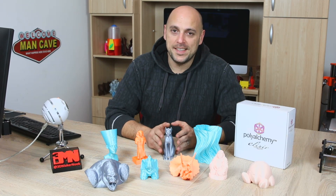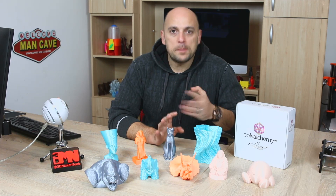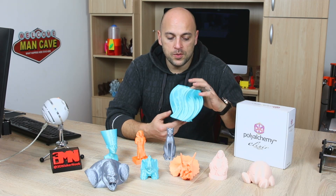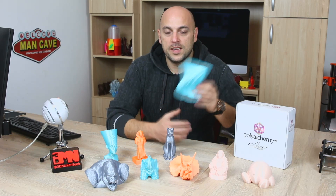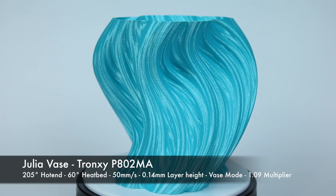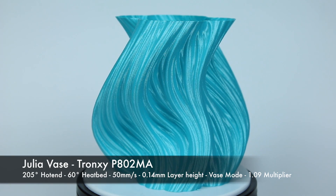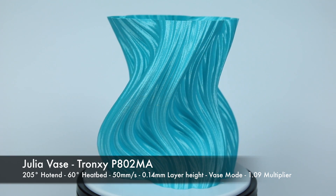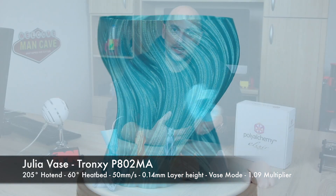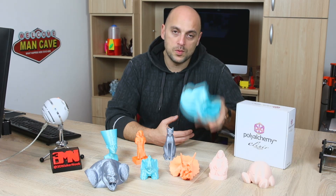Once I tried the Silver Elixir, I also wanted to try the AquaBlue and the Skin. So I grabbed the same profile and replicated it on the Tronxi and also on the Wanhao Duplicator I3+. I threw the AquaBlue on the Tronxi and printed out this Julia vase, and it came out absolutely gorgeous. The only thing I can see wrong with this vase is over-extrusion. The reason for that is the profile set for the Prusa i3 Mark II has an extrusion multiplier of 1.09, and I used the same settings before realizing those weren't the right extrusion multiplier for the Tronxi. But taking that aside, everything else printed out absolutely beautifully.